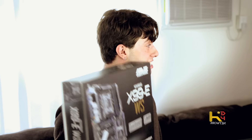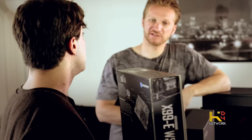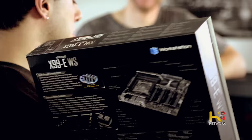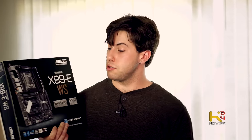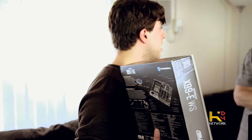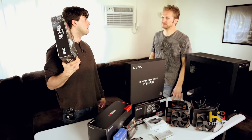This is a workstation-class motherboard — there's no reason a gamer like myself needs it, but it has features I couldn't get on other platforms. It has the ability to run four-way PCIe at 16x/16x/16x/16x lanes using only a 28-lane CPU. It has two PLX chips that allow the processor to access way more PCIe lanes than any CPU normally provides. This means next year I can put three or four graphics cards in here.